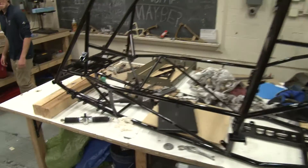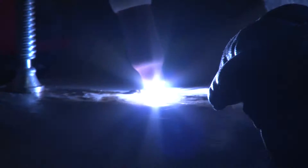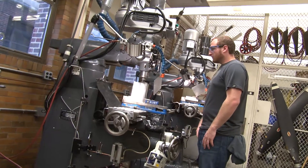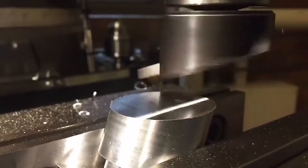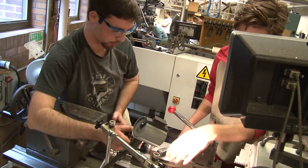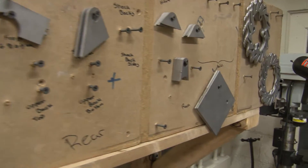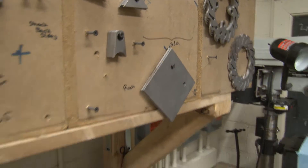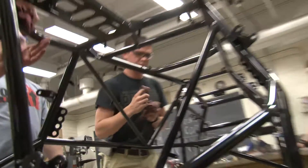First we have to make the chassis, which is the frame of the car. We order all the tubes for that — they get bent and coped and sent to us. We do all the welding ourselves, so it's hundreds of hours of man hours to weld that chassis. We machine most parts out of aluminum: the hubs for the front and rear, the gearbox housing, the gears, the engine mount, the gas tank mount, tabs, a firewall, a belly pan, a steering column, pedal box, pedals. We're making our own seat this year, which is something we've never done before. The list is basically never ending.